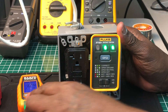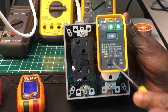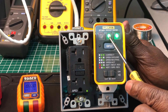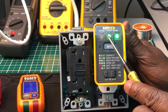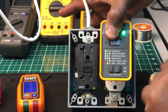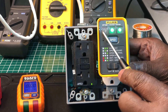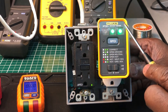Here's the Fluke — it's telling me it's wired correctly with two green lights. For an open ground, only the middle light would be green; the other two would be off. For open neutral, only the right light would be lit. For open hot, none would be on. For hot-neutral reversed, this would be red, the middle green, and the right off. For hot-ground reversed, this would be red, middle off, and right green.